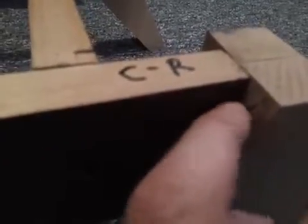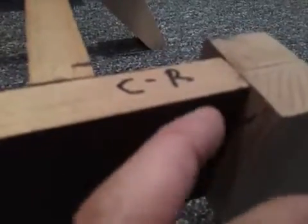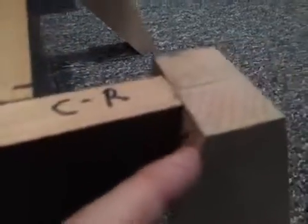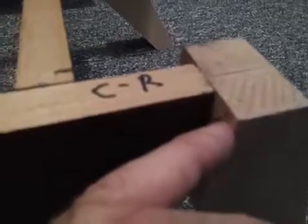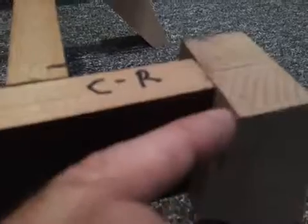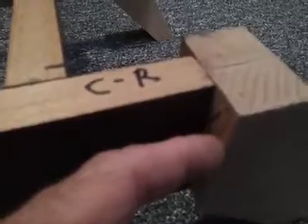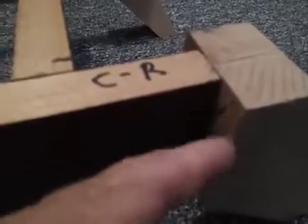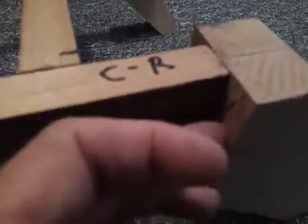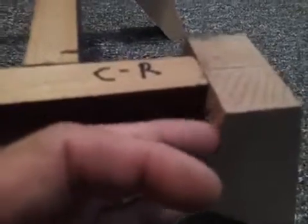But I matched up the holes. I told you how I did that. And then I put glue around the edge of each hole in this piece of wood, the leg, and I actually used a real thin knife blade that I had, but you could use anything, to get it all the way down into the hole, onto the bottom, and make sure that the sides are covered real good. Kind of push along the sides so that the glue will have good contact with it, the Elmer's glue, or wood glue, whatever, it's basically about the same thing, I guess.